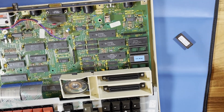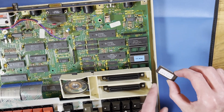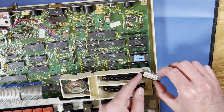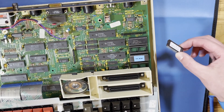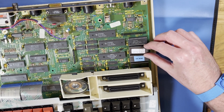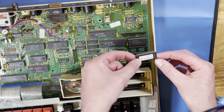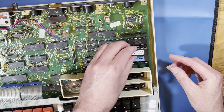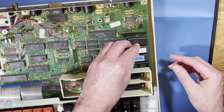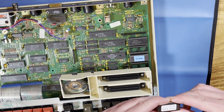This is where we're going to fit the ROM in that empty socket. It's just a case of picking the ROM up and pushing it in there, making note that the notch on the end of the ROM is facing to the left of the motherboard so it lines up with the other ROMs. I needed to squeeze the legs together on this because it looked like the ROM chip had been riding a horse before it got here, so I needed to squeeze those together in order to get that ROM to fit in nice and snugly.